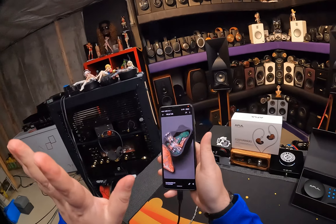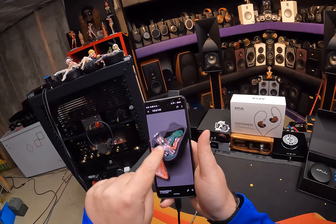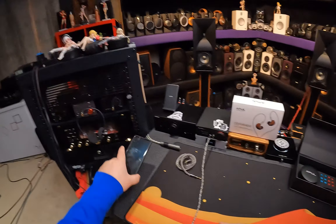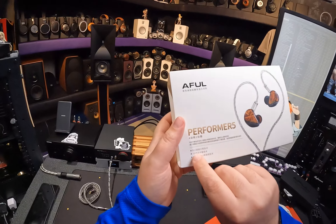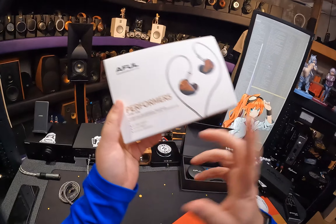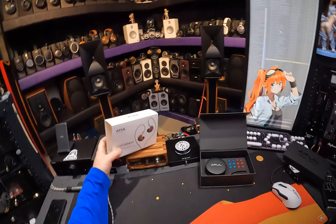It's always been little things, but this is a full board. It's a 4BA single dynamic, and they're all wired to this crossover with at least seven components on this side of the board. This is actual technology. According to what I can read — because the website's not fully updated — it says RLC, 3D, and Resonators with the word 'resin' capitalized, which means it's like the resin that the IEMs are made out of.